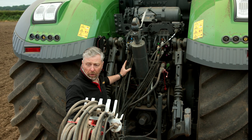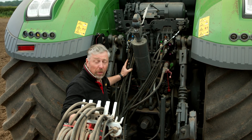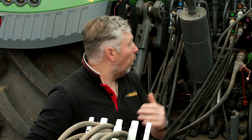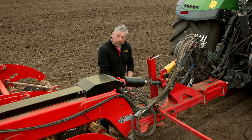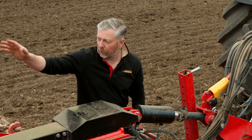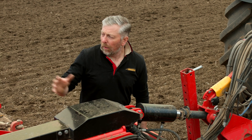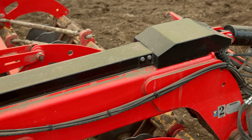On this tractor we also have the ability with the top-down e-Service to use the top-down in a classic way. If we had a problem with the tractor, we can still use it normally on the tractor spools — in this case we need four sub-spools for the four zones. If the tractor had to be changed or failed, we can put a replacement tractor on it that doesn't have LS hydraulics and still go top-down. Here we have a hydraulic filter for the LS — when we were testing the machine, we found contamination in the hydraulic spools at the back of the main beam, so this is good protection for all the hydraulic valves.